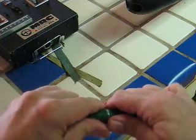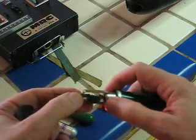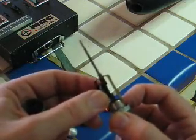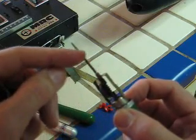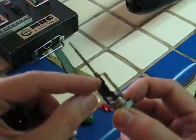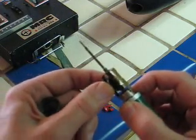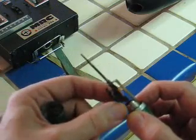It's actually not as complicated as you might think. This is a small servo motor, and what we've got here is a planetary gear, just one running here on the side. As the motor turns, it's a shaft that runs up through the center and a tube on the outside with a small gear soldered to the outside tube. The shaft runs straight through and connects into the motor. The gear, when it's rotating, provides the reversing action that causes the torpedo's propellers to run in opposite directions.